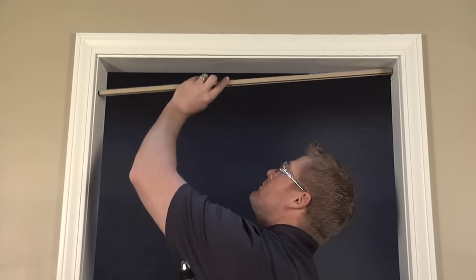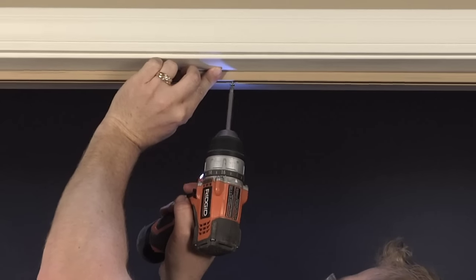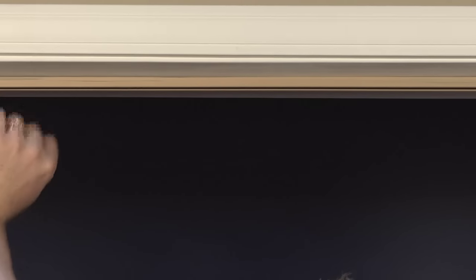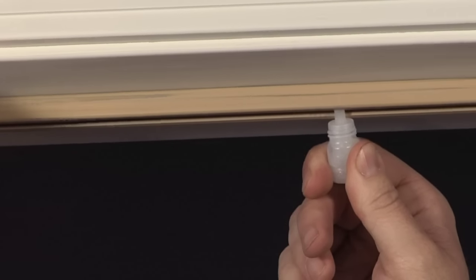Install the top track. Using your drill and drill bit, make a pilot hole through one of the inner holes of the track, then secure the track at that same location with one track screw. Lubricate your track — petroleum jelly works well and is not messy.